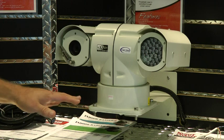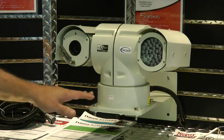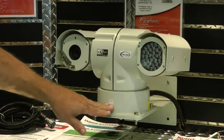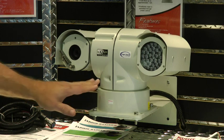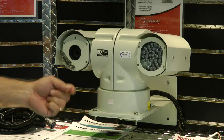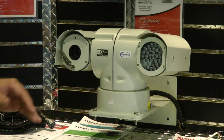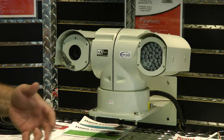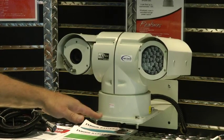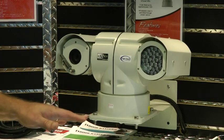This unit is super shockproof. It comes with a vibration isolator mount, but even without that it's rated greater than 4G shockproof. You can do software address changes — it's set to PTZ ID 1 in our showroom, but you can change it to two or three through the on-screen menu without physically flipping a switch like most PTZs. There are four alarm inputs and one alarm output, useful for things like a motion detector on board telling it to turn to a position, or pushing a button to move to a position.